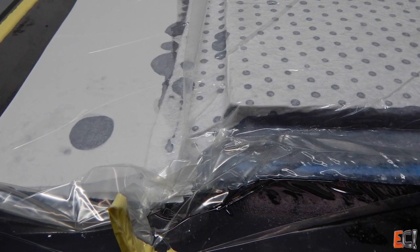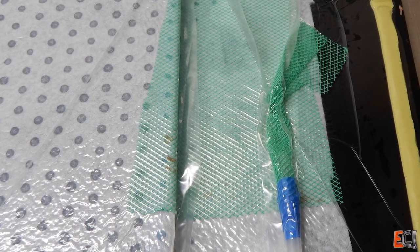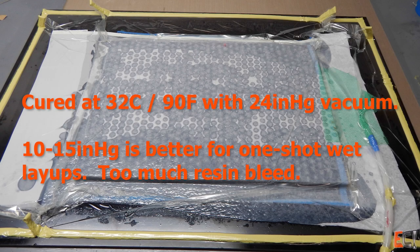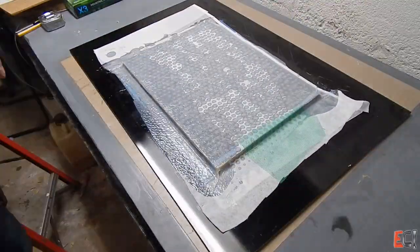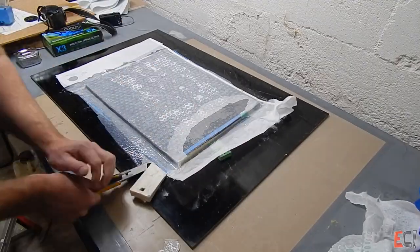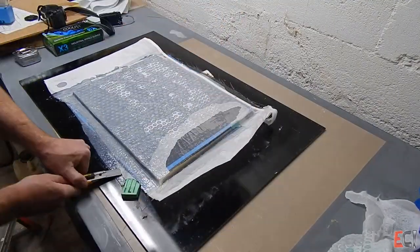You can see some of the detail here. It's pretty sloppy around the edges of the panel because I'm just going to cut it out anyway. There's the mesh going up on top. I cured this pretty warm and cranked the vacuum up, so you can see there was a lot of extra bleed — that was probably a mistake. Generally 15 inches of mercury or so is about right for a bagged wet layup like this when you're doing it all at once. If you're doing the skin and the core separately, you can press it a little more.